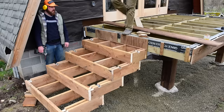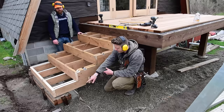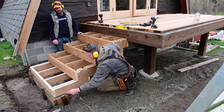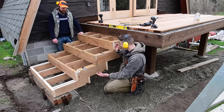It feels solid — maybe somebody will have to get a hold of Matthias Wandel to check my engineering on the stairs, but it seems rock solid to me. It looks really cool to just see the stairs floating like that with no stringers. The stairs are officially installed and everything is rock-solid. I poured a little concrete footer for the stairs to land on, and I had some scrap Trex decking left over so I cut a few plastic shims to hold the framing up off the concrete about half an inch — that'll keep the bottom of my stringerless stairs off the ground.